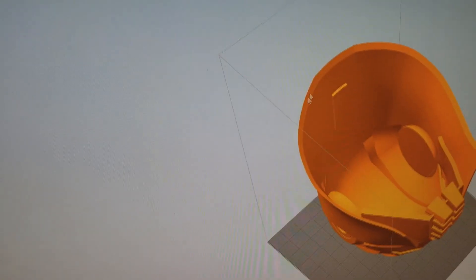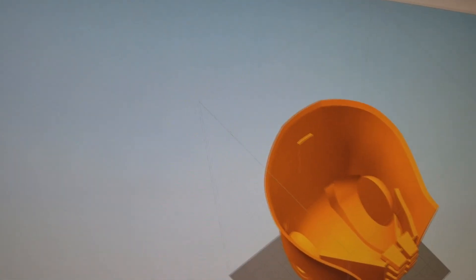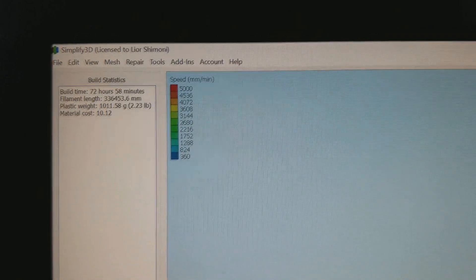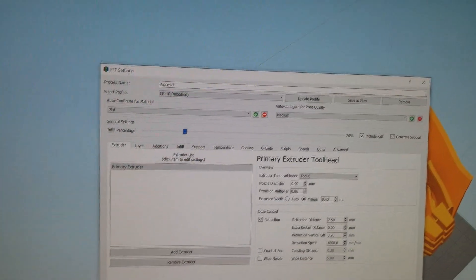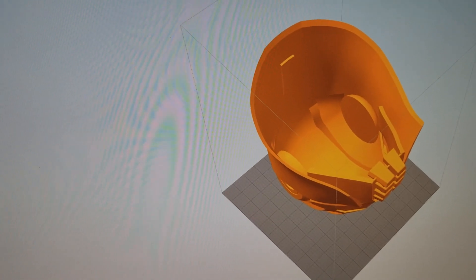It's very light on this side here, and Iron Man is extremely light too. Only when you get into the deeper meshes does it get a little complicated. I'm going to show it at 25% infill — let's just see what we come out with. Parsing G-code file... it comes out at $10.12, which is already going over the 1 kilogram mark. I don't recommend it. Go to 20% — trust me, you guys are going to be extremely happy. So we're going to leave it there, save it, and in the next episode I'll show you it in the process of printing.